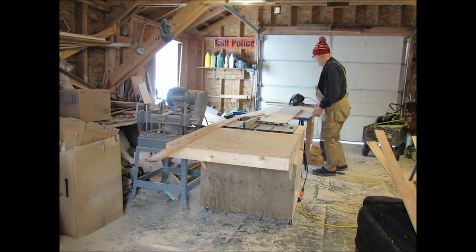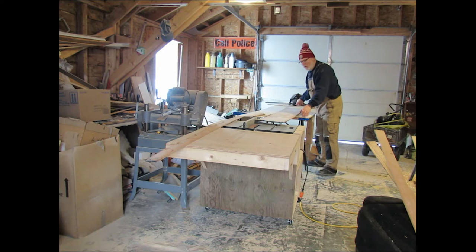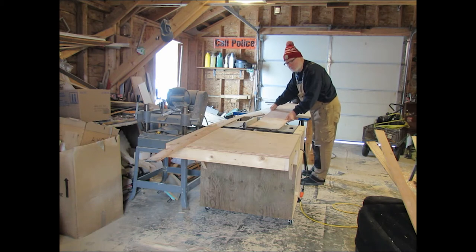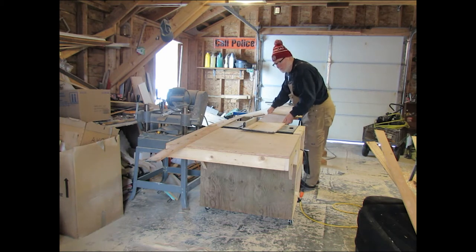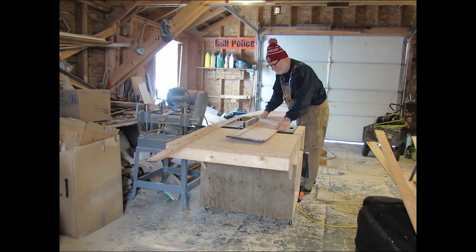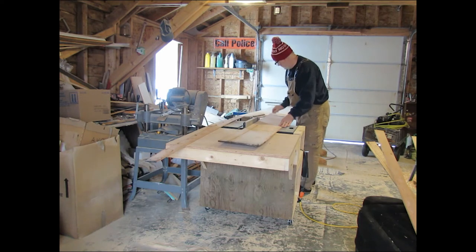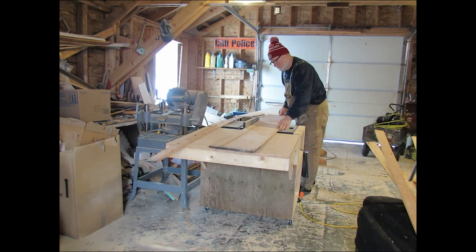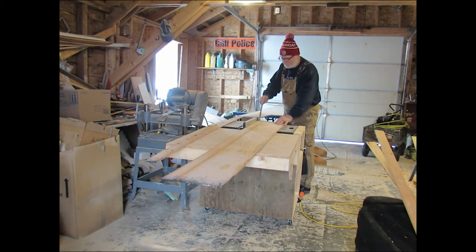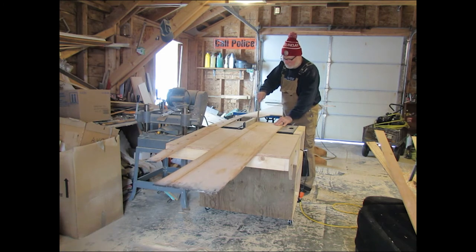With the full-scale dimensions of the keel pulled from the table of offsets and marked, a full-scale pattern can now be created. The patterns are made from quarter-inch ply I had removed from the house renovating the storeroom. Reduce, reuse, and recycle, as they say. The ply is cut into 2-inch wide strips that will then be cut to length as needed.